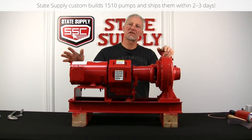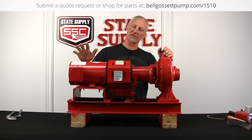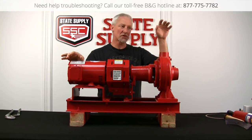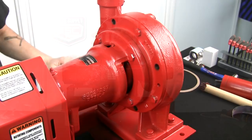How we want to start is turn off your power at the panel and lock it out. Make sure the power is off and that no one else can turn it on. Second, shut off your service valves and then you can start working.